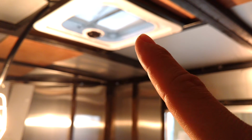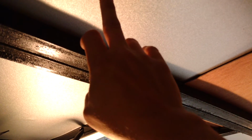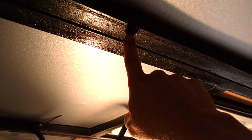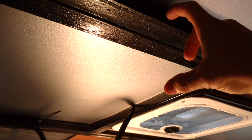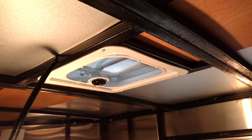And one thing that I've found, and it was suggested by McDave, I think, online, is that the ceiling width has to be 2 inches, and it's currently, of course, just 1 inch with the roof joist and the metal. So I'm going to fur out with 1 inch strips to give me a 2 inch thickness, so I can mount my AC up here, and then I'll put 2 inch stiff board foam up here.